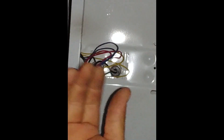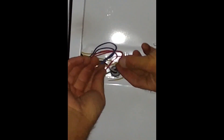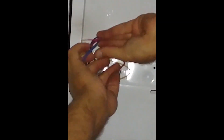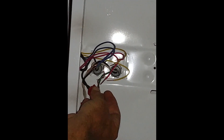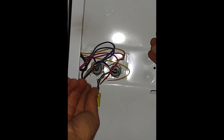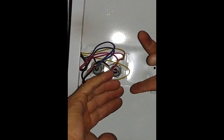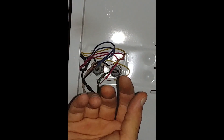This is super simple. This is a 2x4 troffer recessed fixture like we see in offices all over the world, and everybody's got this old antiquated T12 technology. The beauty of our Edison Lighting Supply universal tube is that it will work with a T8 ballast, or you can bypass it — it works as a bypass tube for a T8 fixture or a T12 fixture and T12 ballast. You do have to bypass it.